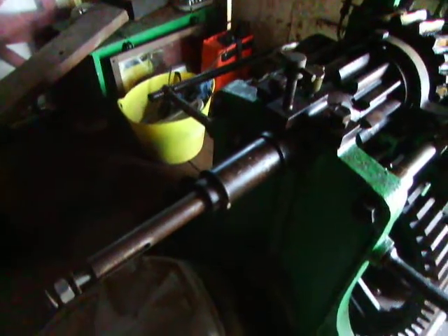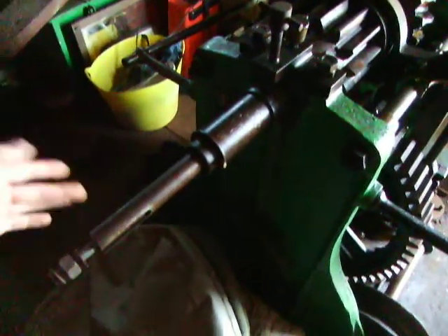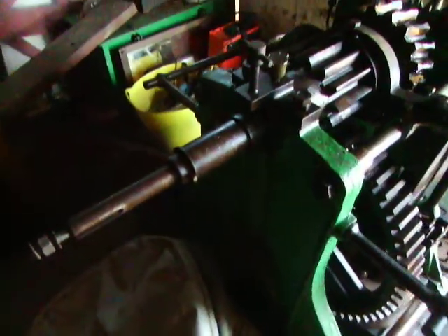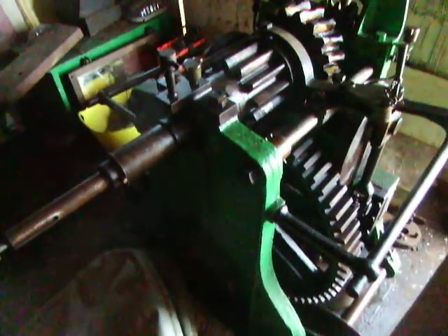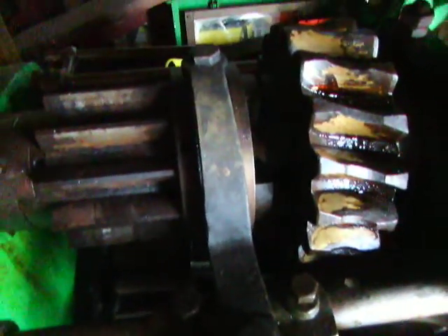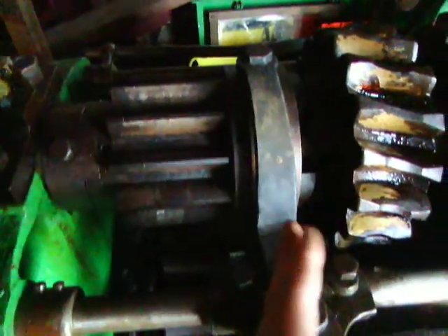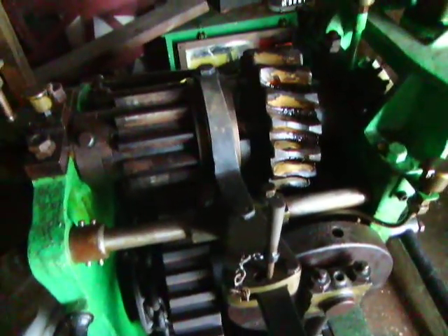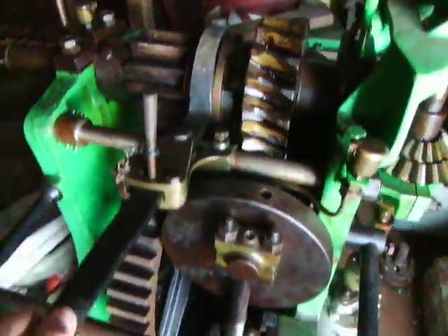You've got two ways to control that from here. On the front of the shaft you originally would have had two ship's wheels. One would have been a smaller wheel, maybe only two feet in diameter, and a very large ship's wheel here about four feet in diameter. The larger one would have been used if the steering engine had failed or if you didn't want to use it, and you would select between the two with this lever — you take this pin out and slide the dog clutches. You can see there are dog clutches here and here, so you're either engaging one or the other. So you could either use the larger ship's wheel which would be manual, or the smaller one which would then be using the steam power.